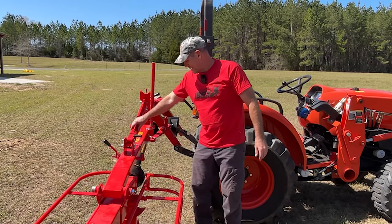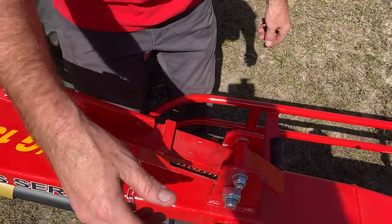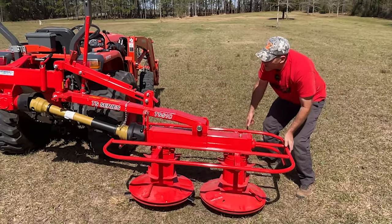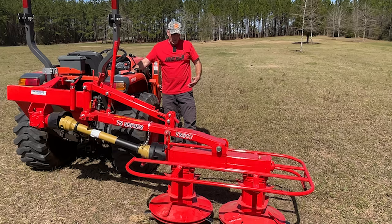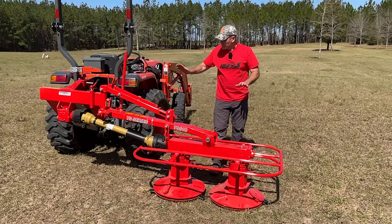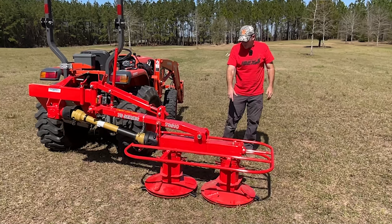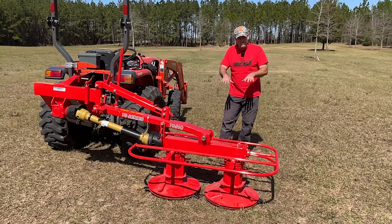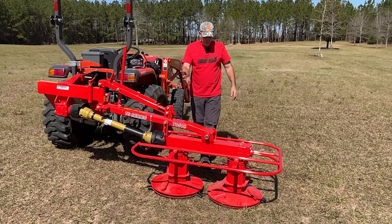This lever here was also in transport mode, so you'll flip that over. Then we'll loosen this up and now the mower can travel up and down — this is spring loaded here and you can see it adjusts as it goes over uneven ground. What's interesting about this mower is it doesn't float suspended. The way you operate this mower is you let down the hydraulics or the three-point hitch until the drums are just barely resting on the ground, and then you adjust your top link — extend your top link and tilt the mower back just a bit so the blades don't hit the ground. The way they're able to follow the ground is because there's a spring inside this box tube metal here that allows it to float. And it's set up for mowing.